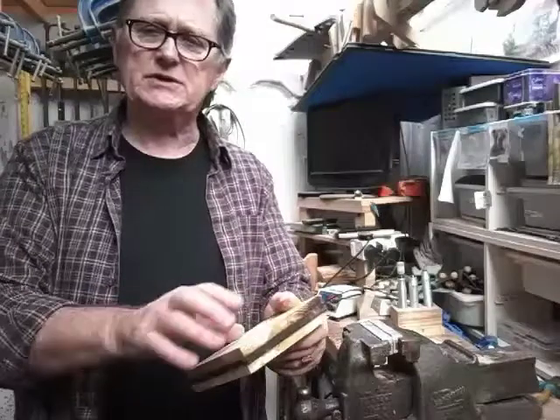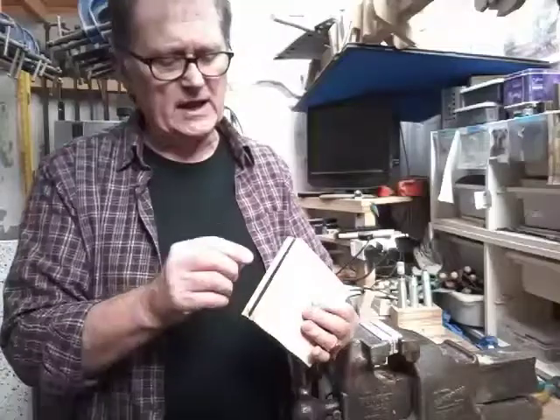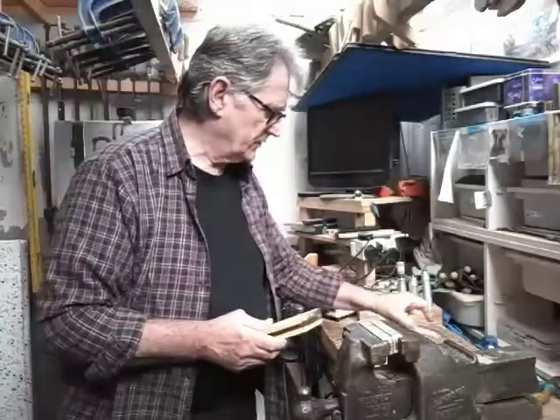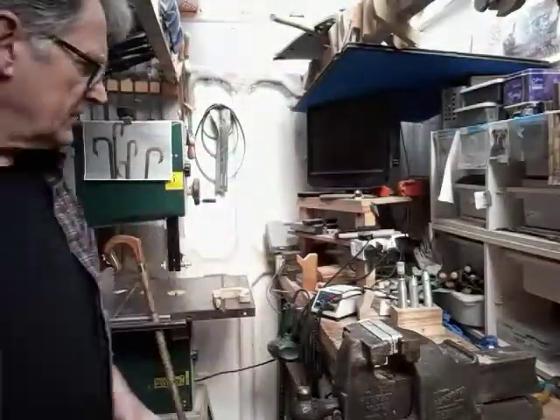Another one we do is an outer edge of ash and purple heartwood. This is very striking once you've made it up, cut it, shaped and polished it — it makes a very striking stick. The only thing with purple heartwood is it does like to move around a bit, so if you put it on the outside you may get a few shakes or cracks in it.